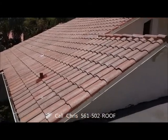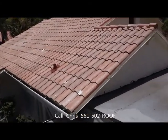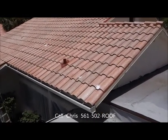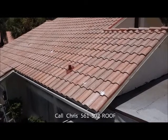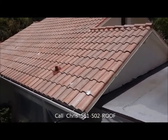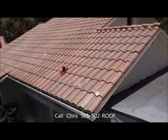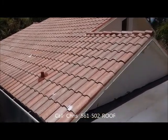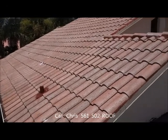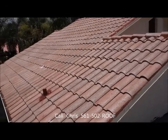Our first coat of paint is going to have our hurricane sealer mixed in it. It's going to have the same polymers that the hurricane sealer has, so the paint is going to bind right onto the roof, right onto the hurricane sealer that's there. Then we're going to put a second coat of paint on there, and that's going to have a little bit more hurricane coat in it, but not so much — we want to keep our viscosity and our thickness so we get a nice thick millage on the job.